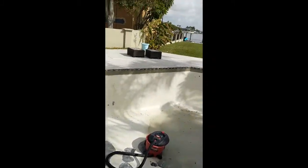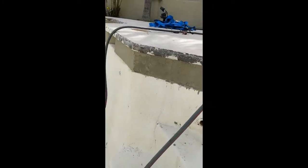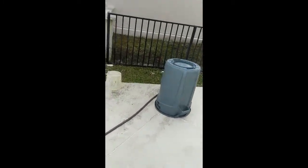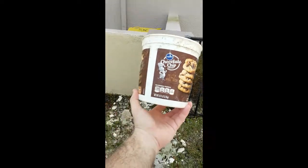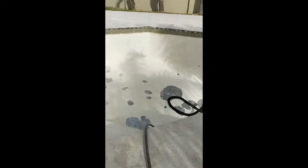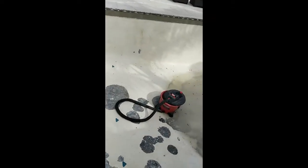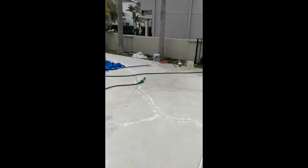I just finished doing the brown coat for the tiles. One important thing about mixing this stuff: it dries so fast — you've got 15 minutes to work with it and then it's a rock. I was mixing batches in a bucket, only filling it halfway up, so this whole section took me about 10 to 12 batches. The very first bucket I made, I used a two-and-a-half-gallon bucket and it got rock hard inside — a lot of waste. That's why I moved to a smaller bucket.